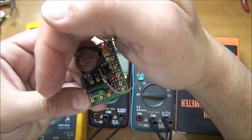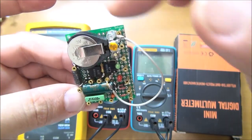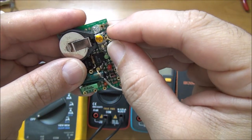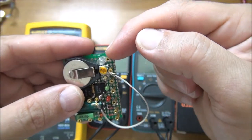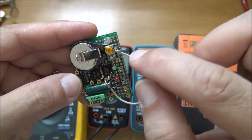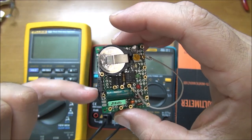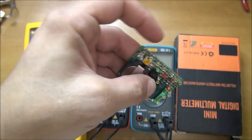You can see a very low light coming from this LED. With this one or this one here I have a fluctuating current, but here I have a regulated current. With this regulated current I can change it by choosing the right resistor to get a different range of millivolt output.